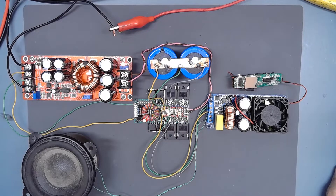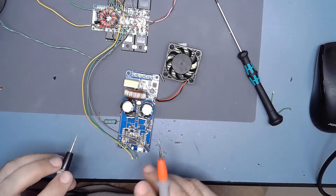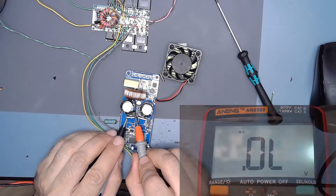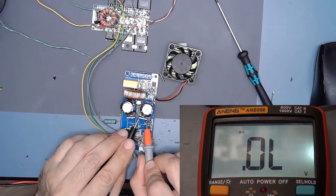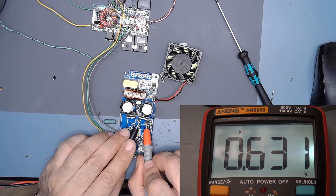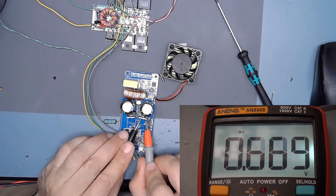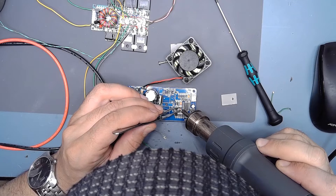I am going now to show you this splitter working very well. The purpose is testing this symmetrical amplifier, which is actually not a fake. If I am fortunate, those MOSFETs are still alive — this is what I am going to check. They are special because they need high frequency capability to work on a class D output amplifier stage, and they seem to work again.